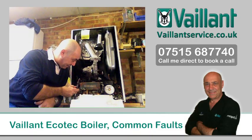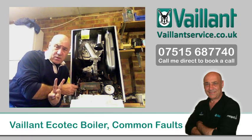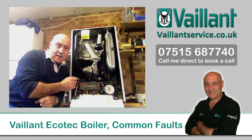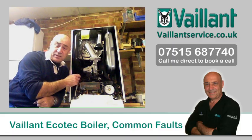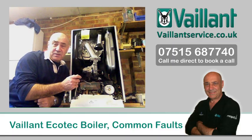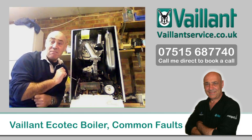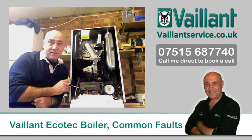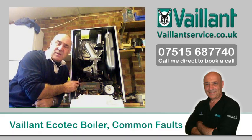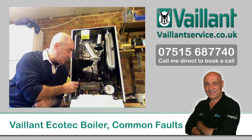Next, sensors. There's an electronic pressure and flow sensor here, and this has been modified three times. Whenever I see one of the older sensors in a boiler, I automatically change it. I call it Christmas insurance, because I know you're going to ring me up on Christmas Eve saying you've got an F75 fault on your boiler. Never leave the old sensors in — just put a new one in, they're £20, really easy, no big deal.